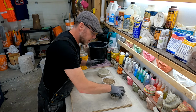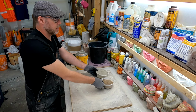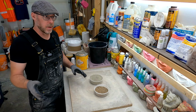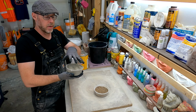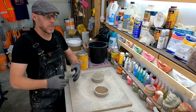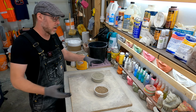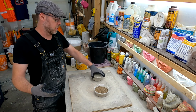So, first, with a feathered edge, we don't need any gravel in this mix design. The mix design is going to start with the backbone of Portland cement and sand. And the ratio proportion, if you're new to mix design, everything's based on the cement component. So one cement component. For me, it's this little Tupperware dish here. It could be a dish, it could be one shovelful, it could be one 5-gallon bucketful, whatever the case is, as long as you observe the same ratio through your mix, then it will scale up to size.